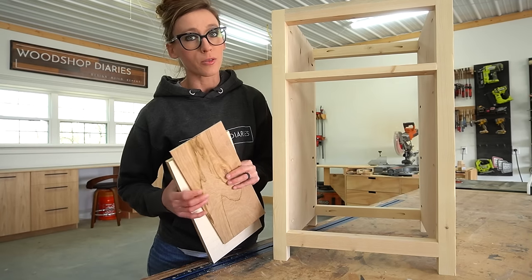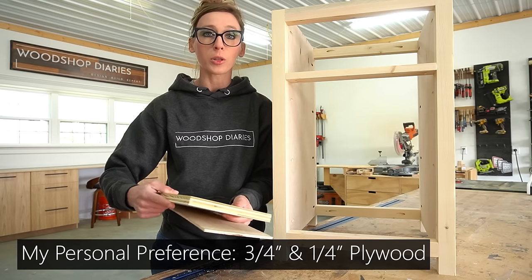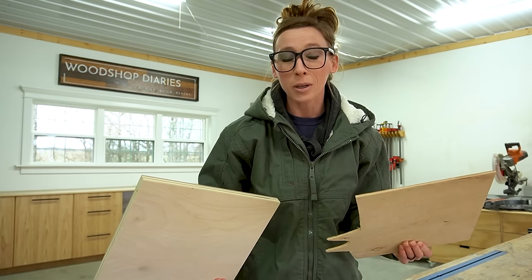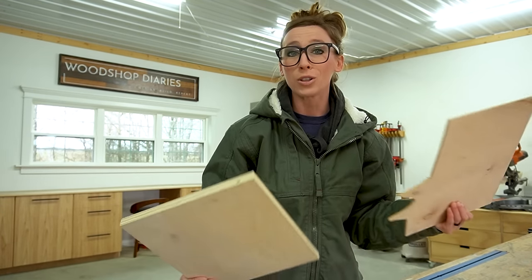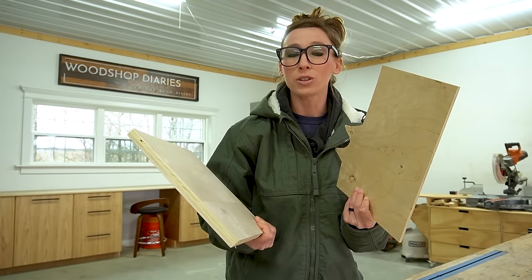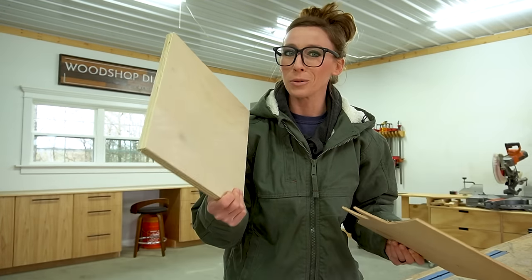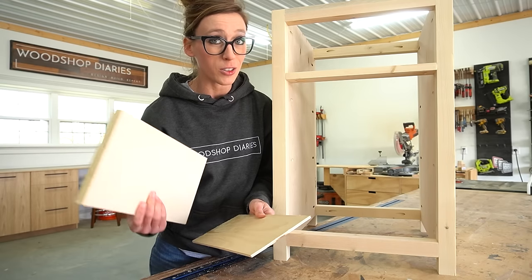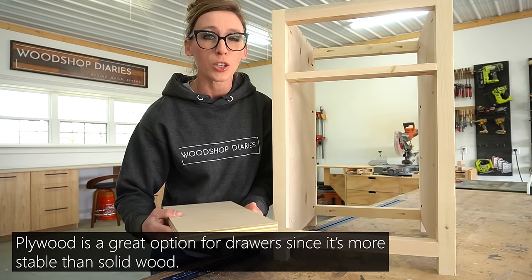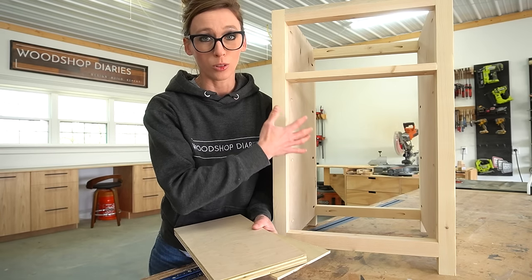Based on my calculations from part one, I've determined that my drawer boxes for this cabinet should be 16 inches deep, 14 inches wide, and four and a half inches tall. But before we start cutting anything, let's talk about materials. You can assemble your drawer boxes from tons of different kinds of materials. I'm going to be using three quarter inch plywood for the sides of the box and quarter inch plywood for the bottom. I typically just keep three quarter and quarter stocked in my shop, so I'll use three quarter for the sides and a quarter for the bottom. A bonus to using plywood is that wood movement is very minimal, so you don't have to worry about it expanding or contracting and putting stress on your slides.